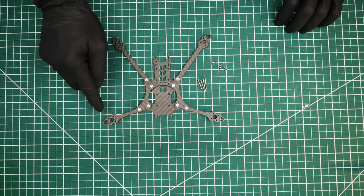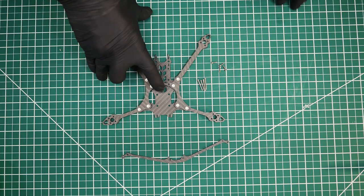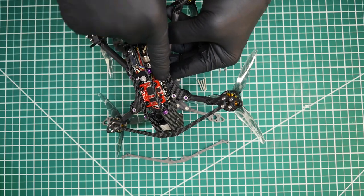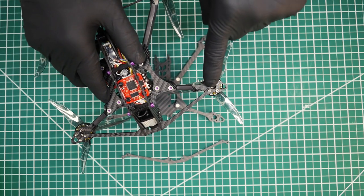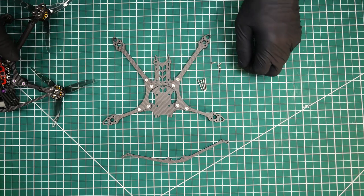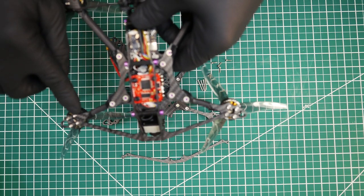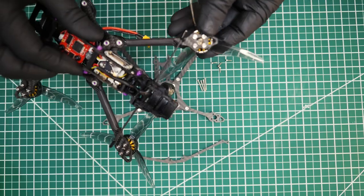For the next part of the build, you're going to install your motors, install the front brace, and the speed controller. As a reference, I'll show you what it looks like on the finished build. The ESC is installed in the center and motors on the ends of the arms. To install the brace, use the four M2 by 8mm screws that come in the kit — those go through the brace, through the arm, and into the motor. For all other locations, use the screws that come with your motors.